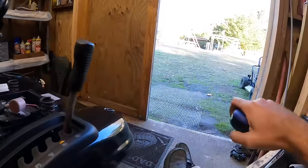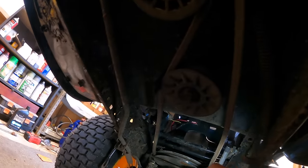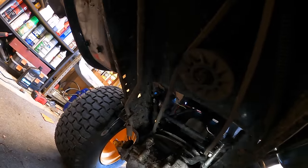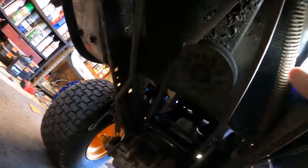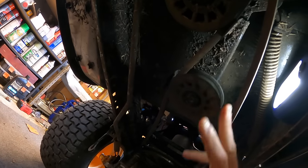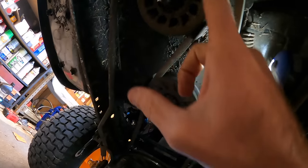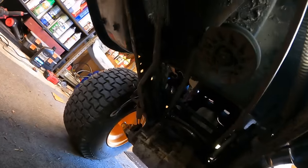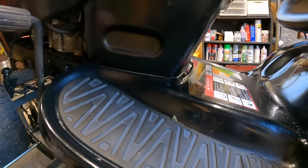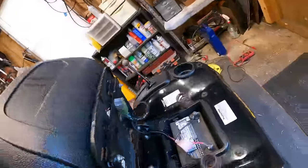I've got the paint on the mowing deck. Let's take a look underneath — so far this looks pretty good. The drive belt on here looks like it's probably been replaced at some point, or this is a lower-hour machine. Other than being dirty, everything seems pretty solid. The idler's just rubbing the belt a little — that's the noise — but it's really smooth. All the pulleys look good. Deck belt is good, drive belt looks good, we've got all our gears working. I still need to check the brakes.